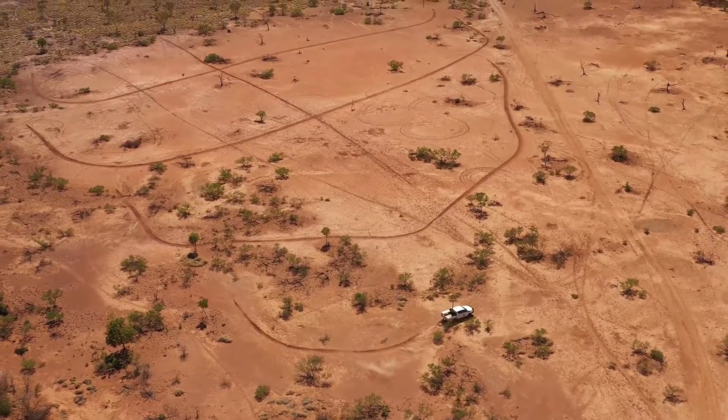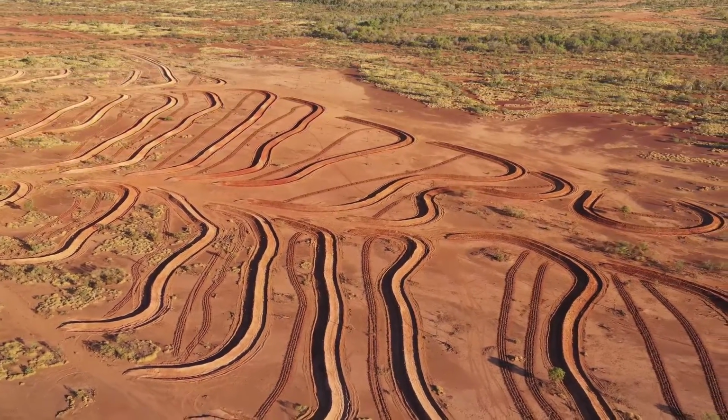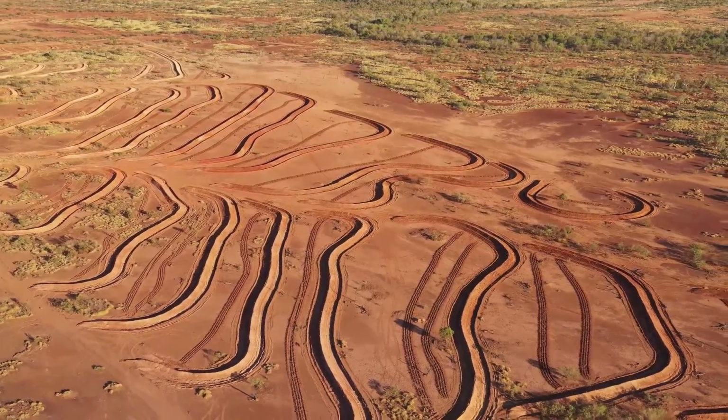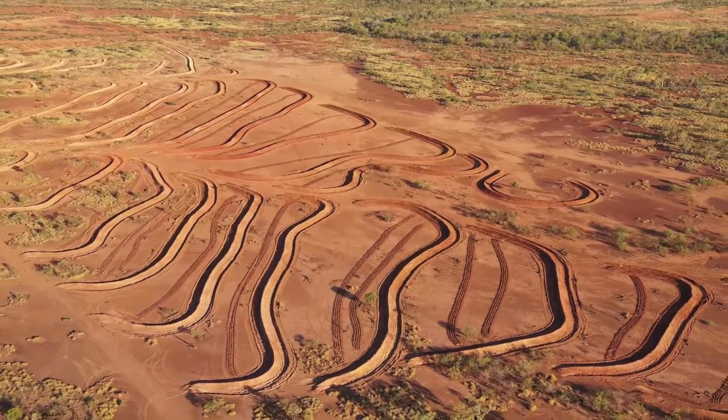A few important tips with the actual survey and the construction. For the survey, you start from the very top of a clay pan and work down the slope, and you can fit in your ponds a lot better. The road grader, come construction, starts from the bottom of a clay pan and works up the slope, so he's never running into a bank. The quicker the grader can get around, the easier and cheaper the whole process is. If he builds from the top down, he's running into banks every leg, and that's very expensive. So just remember, survey from top down, construction from bottom up.